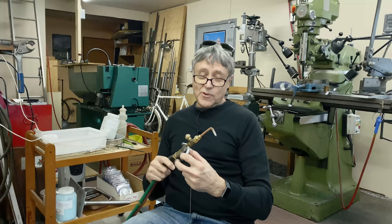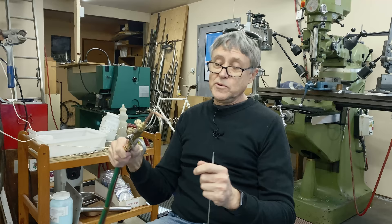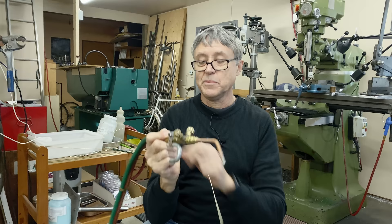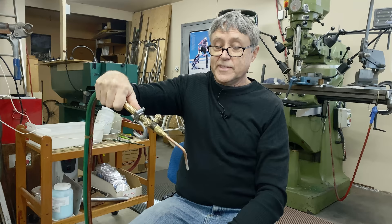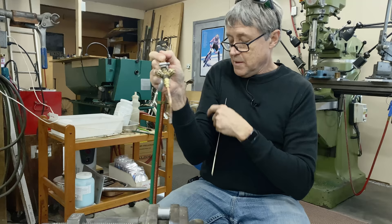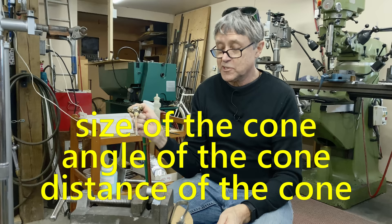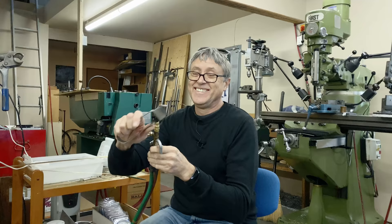So please remember those three things: size of the cone, angle of the cone, and distance of the cone. On the angle — I can hold the torch in a pistol grip, or there's a pencil grip. If you're brazing for an hour or two with a pistol grip, you're going to get a sore shoulder. That's when you want to hold it like a pencil — you've still got the torch at the same angle, but you can do it a lot longer. We're going to light the torch now. I'm going to get my brazing rod, 3/32-inch, and build you an icicle.